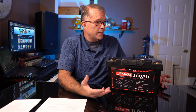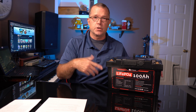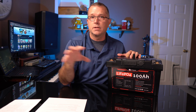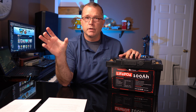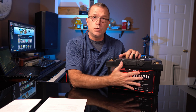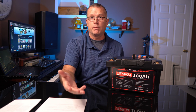The last thing I would mention — and this is not unique to this particular battery, it's kind of a general rule — is that when you're looking at a lithium iron phosphate battery and trying to size it with an inverter, you want your amp hour capacity rating to be about 10% of your inverter's output rating. So if you have a 1,000 watt inverter, a 100 amp hour battery is appropriate. If you've got a 2,000 watt inverter, a 200 amp hour configuration — which would be two of these in parallel — would be appropriate.